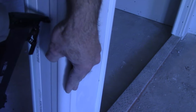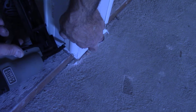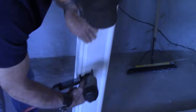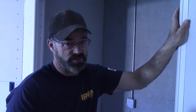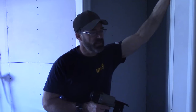Use that one hand to hold it in place, because if you don't, you might get some wrinkling. Go ahead and attach that. Some people do it double on the bottom, and then you can just come back and fill that in — go every six inches. Then you can take any wrinkles out of it that way. Really good way to do it. I do it that way because I hate hitting my thumbs, and with the way my hands shake, it's hard for me to fasten with nails. So the stapler is an excellent way to go. It's attached to a small two-horsepower compressor — you don't even have to have two horsepower, just enough to run this little stapler. Once you get it stapled, you're ready to put the mud on, and that's a whole other story.